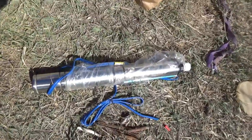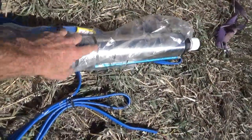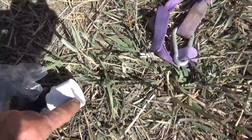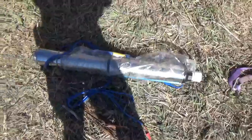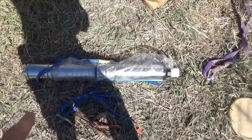Then we have to put in the well pump, which is going to go right here. Lots of ways to get water out of a cistern — you can pump it from inside the building and just plumb it up. But we're going to use a very high power, economical way to pump water from a cistern into your house, and that is to buy a deep well pump. This is a deep well pump that you would normally slide down a well casing 200 feet down, and the water would be pumped up this inch-and-a-quarter all the way up. This one can go up to 600 feet, and we have 600 feet of head here on a very high power — I believe it's a half horsepower, 8 amp.